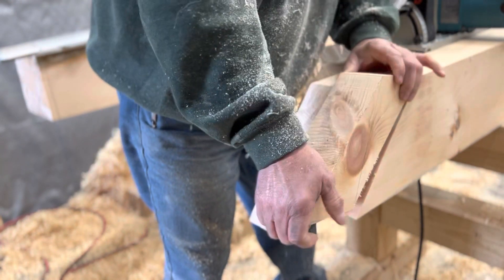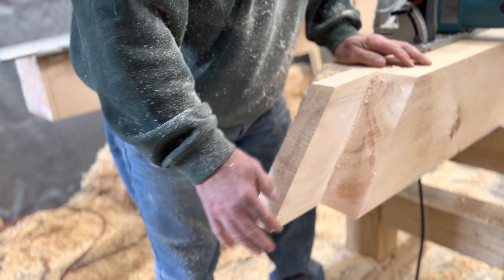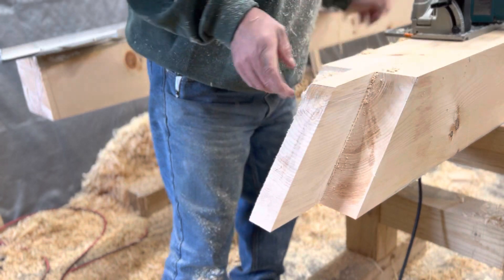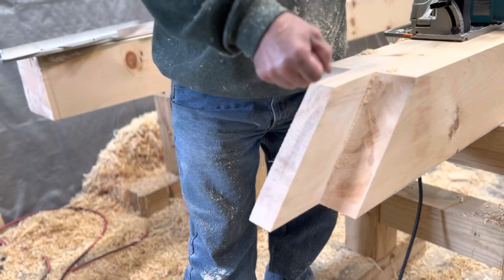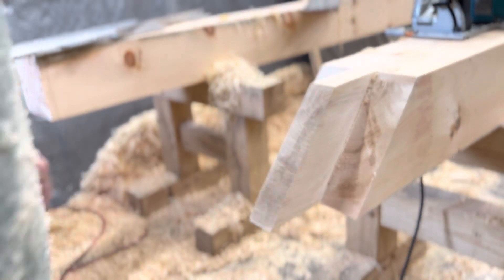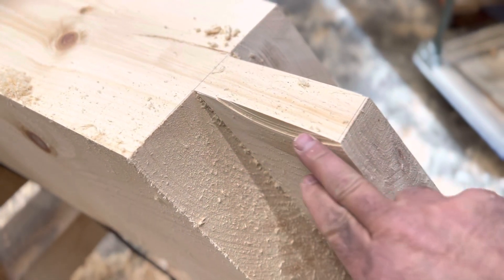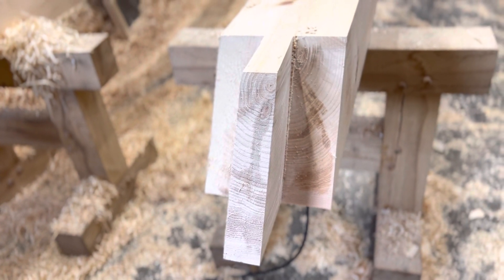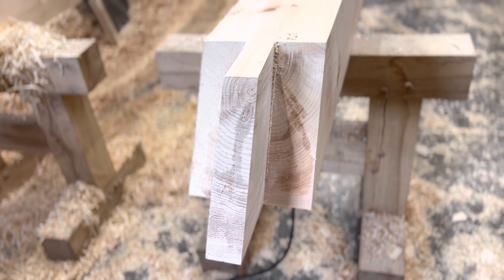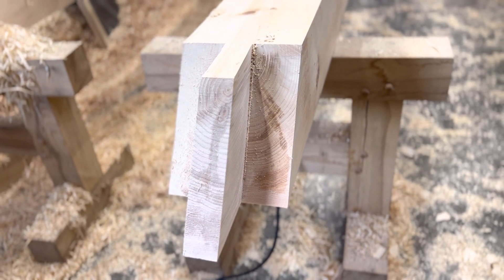Well, this one didn't quite fall off but she's close — there it is. We'll have a little bit of chisel work to clean up. So that fell off. You can see I'm a little inside on my drop, trying to maintain the tenon thickness. So there you have it — that's a drop cut on a rafter end. I feel as though I've got some control here. I really don't prefer doing a drop cut up and down — some people can, if you've got experience and you like it, that's up to you. You're going to see a bunch of sawdust — I'll clean that up. You'll see where I came in here with a curve first time and took another bite — I'll clean that up with a chisel. Over here I'll clean this up with a chisel, and we'll put our gauge on it for the tenon, make sure we've got two inches, round off the edges a little bit, and we'll call it done. There you go — that's a demonstration for a drop cut on a rafter top cut. Give me some thoughts, give me some feedback, click like and subscribe. Thanks guys.